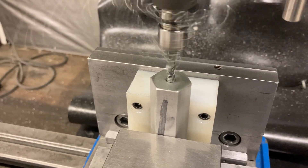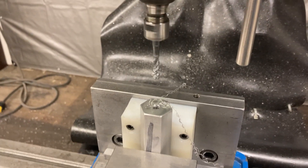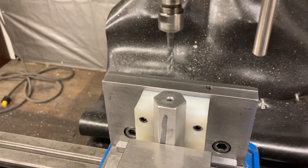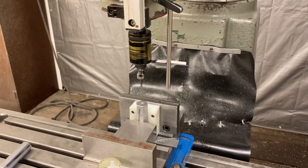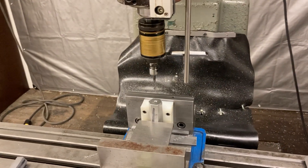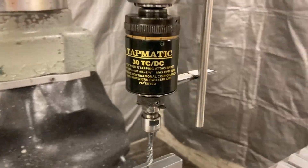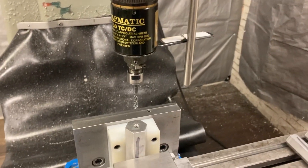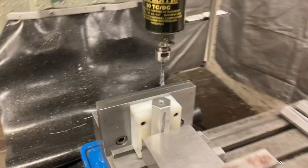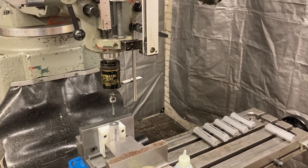I just back out just a smidge and then go back down and bottom the tap again, just to make sure I've gone to the proper depth. Look at that — gotta love it. All right, so here we are at Titan Machine Tool showing you how we tap blind holes — six millimeter blind holes, 9mm deep — using the Tapmatic tapping head with a high spiral tap, which ejects the chip out of the hole. Thank you for watching, please subscribe, have a good day.